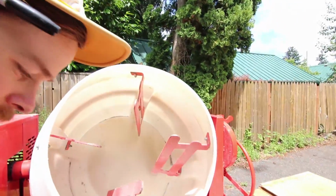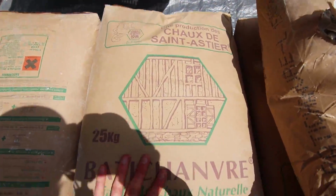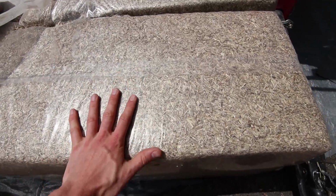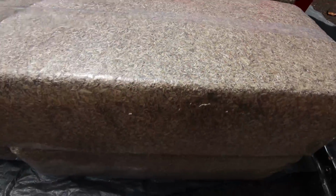Let me introduce you to Multi-Quip here. We call her MQ for short. She's gonna be mixing this stuff together, and literally we're taking one bag of this lime binder, 25 kilo bags, with 100 liter hemp stacks. I'll put links and stuff as far as the ratios and the material you're using, so if you're interested in doing this combination, you know what kind of ratios to use. So, link in the description for that resource.